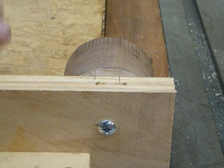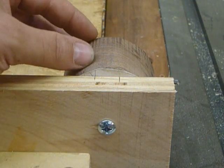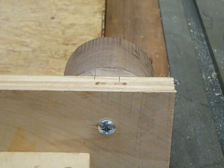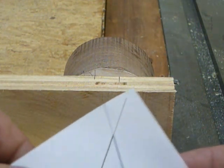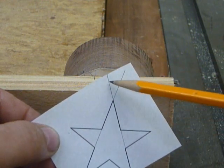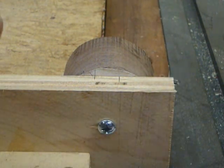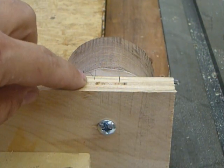Looking at the jig from this side — this is the side of the table saw that we would normally be working on. You can see that I've got my blank basically screwed into place here using the bolt. Now if you think back, the way that we laid out our star pattern, we crossed every point. What that did was give us two sets of lines. This can be a little confusing, so just try and pay attention. Remember, we're only working on this side of the jig right now.